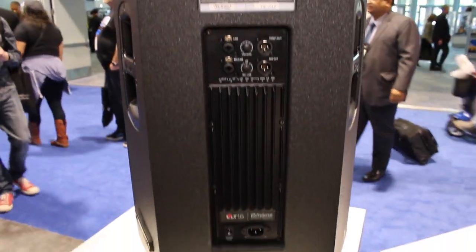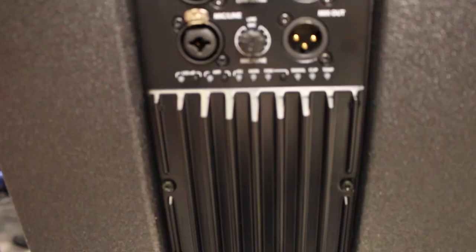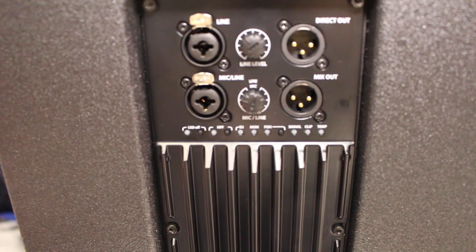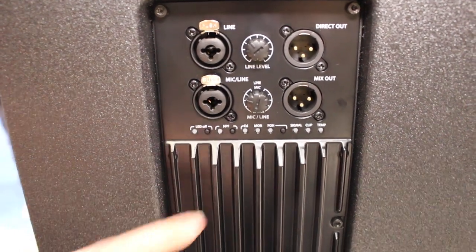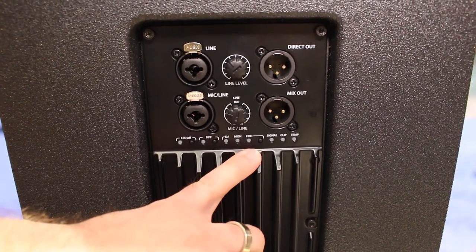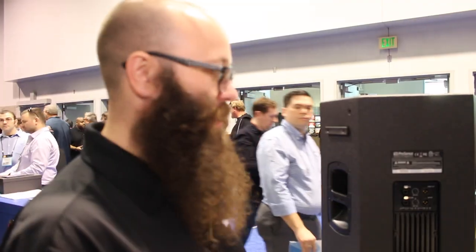In the new power amplifier we have here, in addition to your inputs, you have a few different settings. You can turn the LED off if you want, so if you're doing an install and don't want it lit up. We've got a high pass filter setting — if you're using it in conjunction with the subwoofer, you want to set the high pass filter on so you have a nice tuned crossover point on it. And then there are also settings for the tuning mode: whether it's front of house mode, monitor mode, or a DJ mode that gives you that smiley face curve — a little extra highs and a big clump of lows.